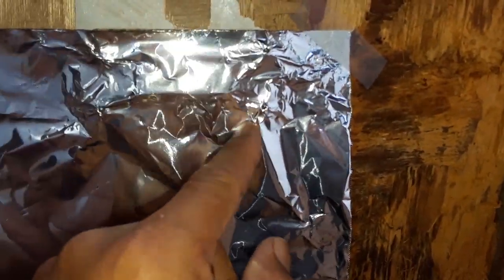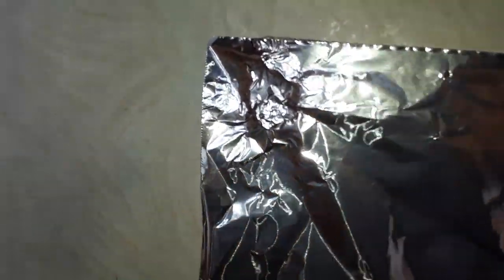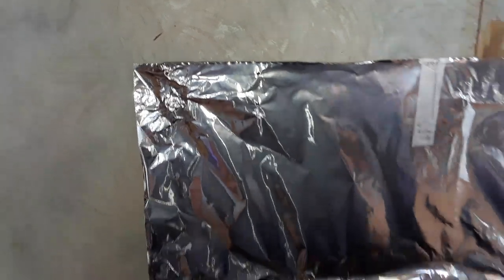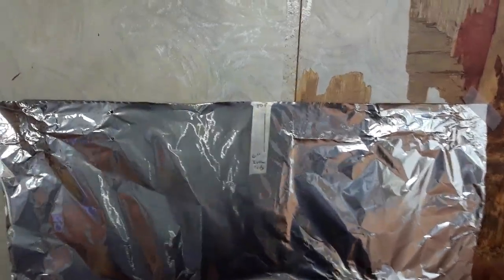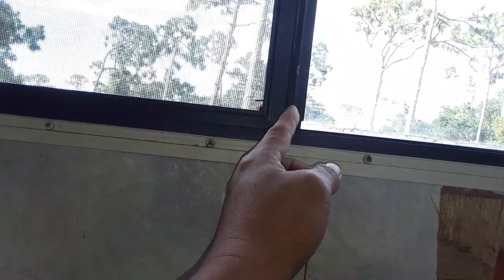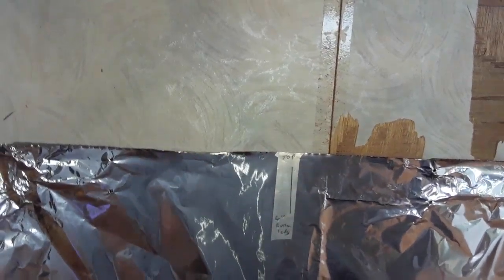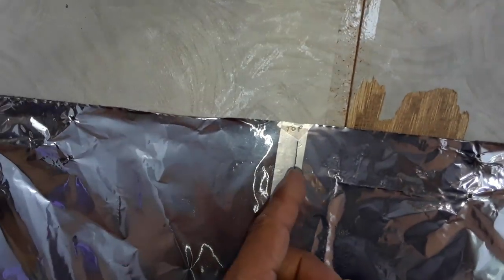And I used it to make holes. I know it might be hard to see, but there's a hole there and another hole there — those are the screw holes. And then there's a hole here and another hole there — that's the screw holes for the tops, and I did the same with the bottoms. And then to measure how low down I went, I made sure I went from this ledge right here and lined it up to this line where the screen is — and it's six inches from the ledge to the top of the aluminum. So I wrote on here six inches at the top, and this line right here is the center. And that's how I'm going to transfer the pattern to that one.